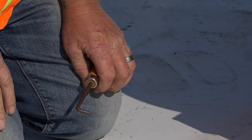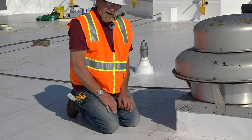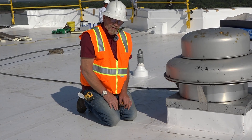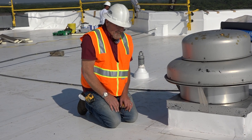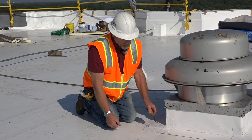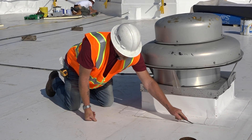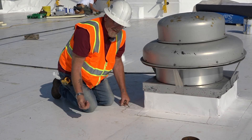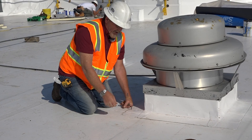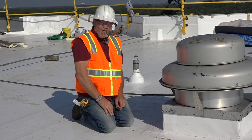There's another thing that you want to watch for too. It's called a hot-cold weld. It's actually where a machine or a hand welder starts and stops again. That's one thing you've got to really watch for. Anytime you get a void, it's as simple as just taking a marker with you — a Sharpie. You mark the void and then you're going to come back after all of the probing.